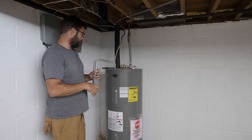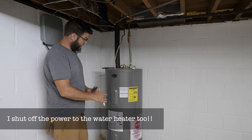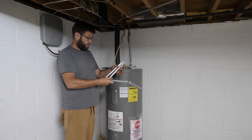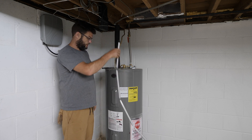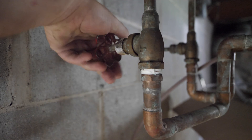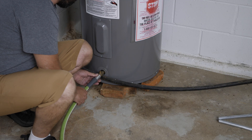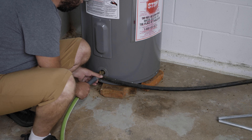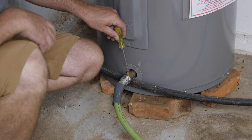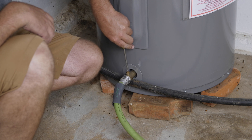To get started I'm going to shut off the water and drain out just a little bit of water, then pop it open, take out the old one, and put the new one in. I've got a hose to hook up. My water heater doesn't have a spigot handle so it just needs a flat screwdriver to drain out a little bit.